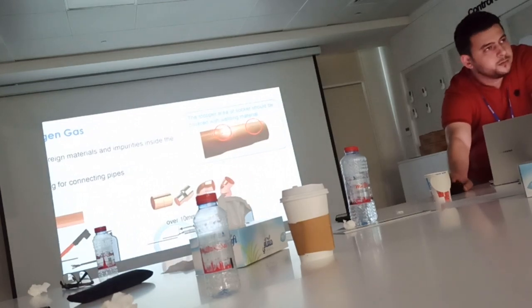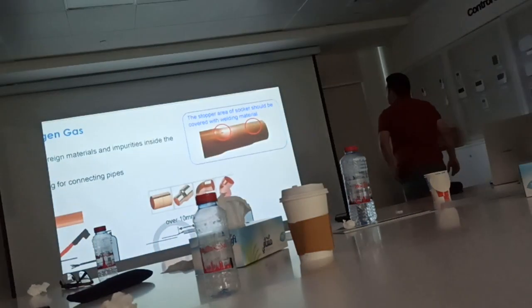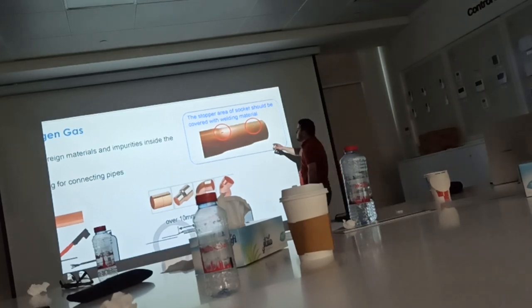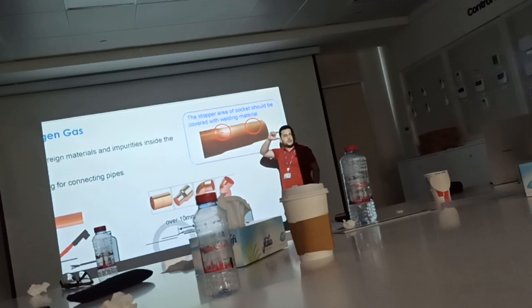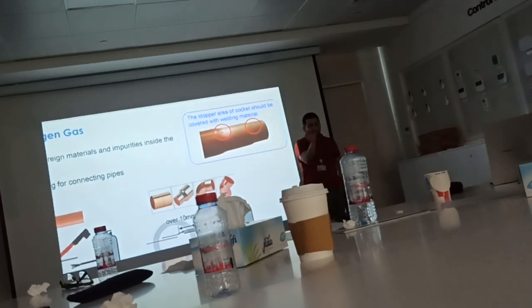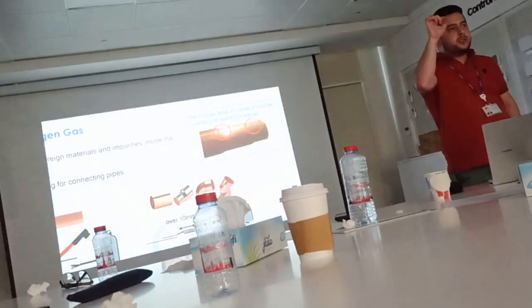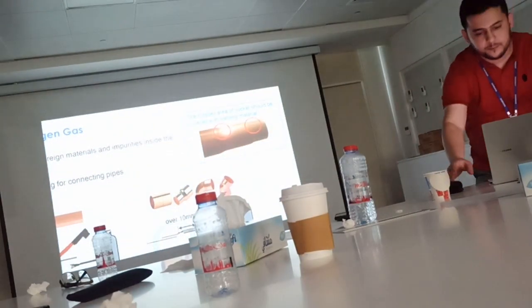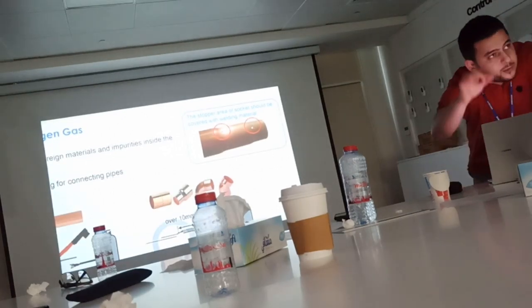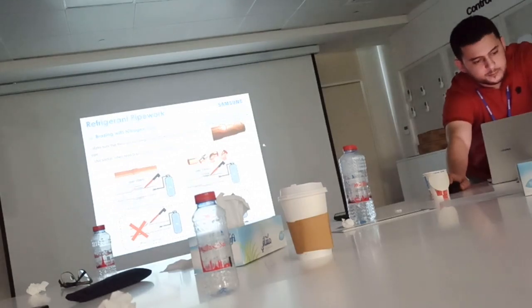at our Y joint, you will find at the reducer of the Y joint a stopper hole. Okay, this is the stopper from outside. This is the location of the stopper where the pipe is stopped. You need to make sure that it's brazed as well before you do the insulation. You should do a point brazing, just a little brazing on that to cover this. Okay?